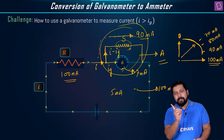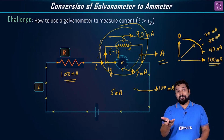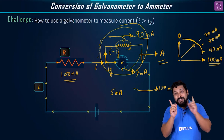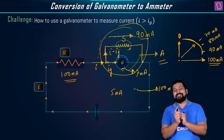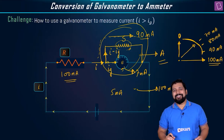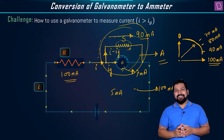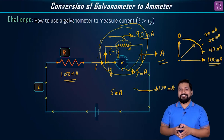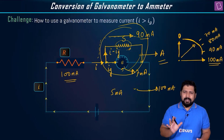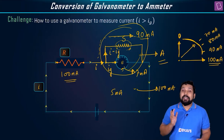The deflection of the galvanometer itself is the same — Ig is still the maximum deflection. But now, when 10 mA flows through the galvanometer and it reads 10, we know the actual current is 10 times more. We know the ratio because we are the ones fixing the shunt. Most exam questions will ask you to calculate the value of the shunt to make an ammeter of a given range.